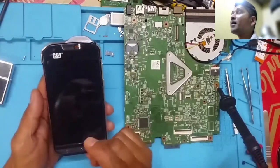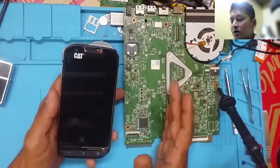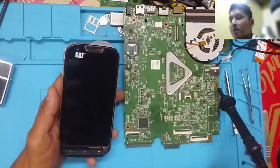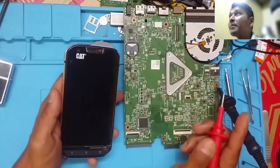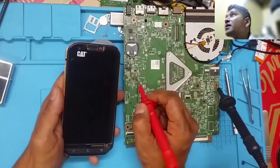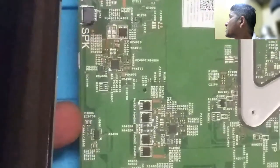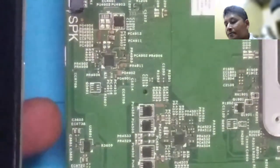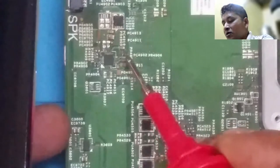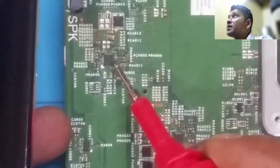Okay guys, I've got a small demonstration that I want to do for you guys. I've got an old motherboard — one of my old scrap that I've had for a while. I'm going to inject one volt with one amp from my DC power supply to this motherboard on this capacitor here. Let me zoom in if you guys can see. You can see there is this capacitor here. On this cap, when I put one volt with one amp, this chip here gets hot.